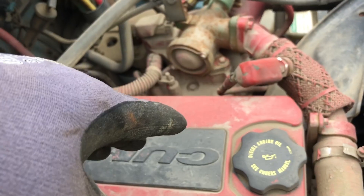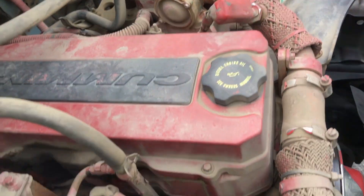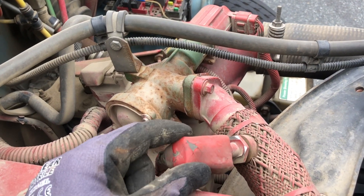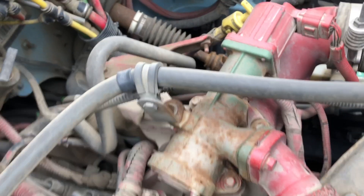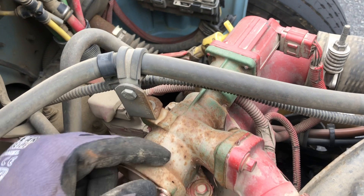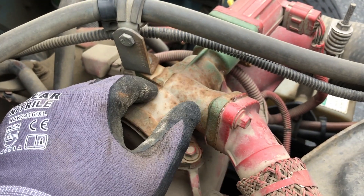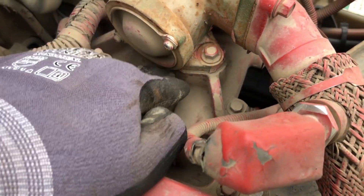As the gas goes this way it goes back to the intake. There's a sensor here — this is the exhaust gas recirculation sensor — and here is our EGR valve. It's like a diaphragm that opens and closes: when it closes it doesn't allow any exhaust gas through, and when it pulls open it lets the gas inside. And this here is the intake.